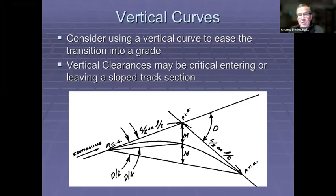You can do that with spacers. We've used those pieces you can buy at the lumber stores, a shim, and they sell long ones that are 12 or 15 inches long, and they go from maybe 3/8 of an inch down to nothing. Those are wonderful adjusters to start coming into your slope and make a gradual change. But you really should do some type of a transition between the two grades.